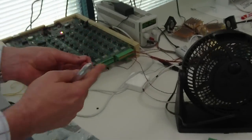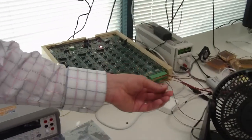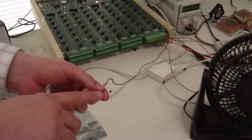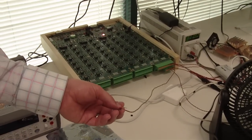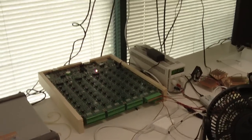What we just did is take out lethal wiring and replace it with low voltage. Look — it's on and I'm touching it. You might get a little jolt at 60 volts but you can never get seriously hurt by it. This is intrinsically safer: you can't get shocked by it, and you really can't generate any significant heat or fire risk. Over time, inspectors are going to love this. If a fireman has to cut through something during a fire, he hates cutting through live wire — live wire kills him. With this system, he can crawl through the plenum right next to it and not worry.